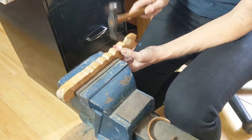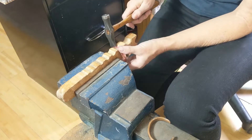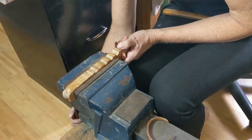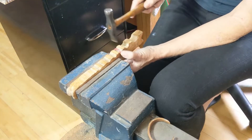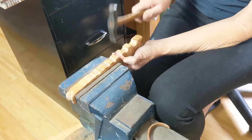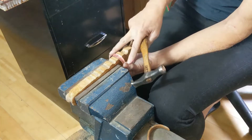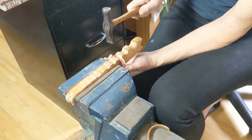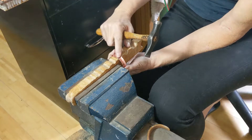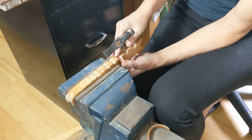'So you can see how much it mattered that you had a nice smooth edge, and fairly straight, and that you started at the ends, because it's really hard to do when it's round. So I've now gone from here to here to here. It's a little bit more tight, because I want to curve it a little more. And the more you curve it this way, the more it wants to open that way. So that's why I have to grab it on both sides here. Even though I'm striking in the middle, I'm not actually hitting the bottom — I'm only hitting the metal. What it's doing is forcing this lip up by striking here, forcing that up more, while not opening up, because I'm holding it.'